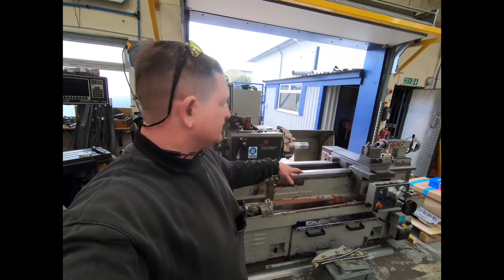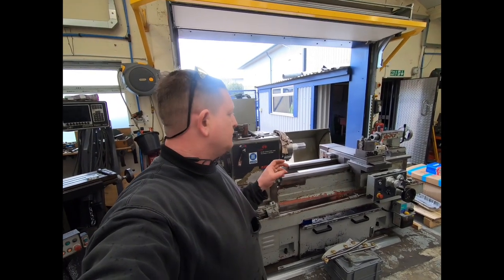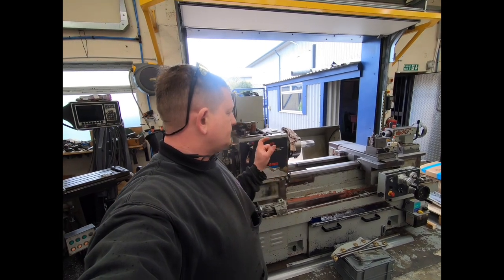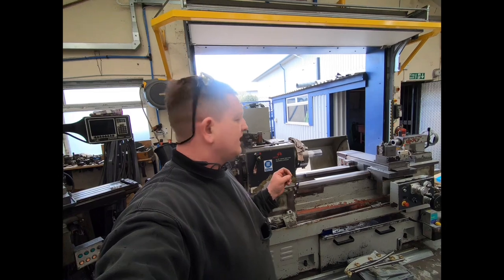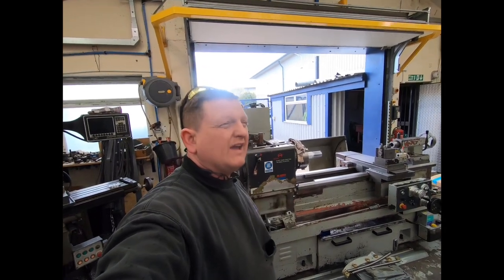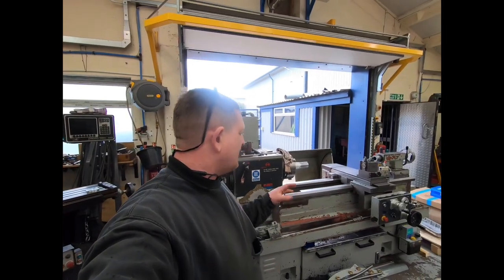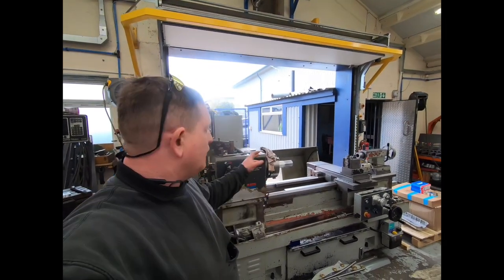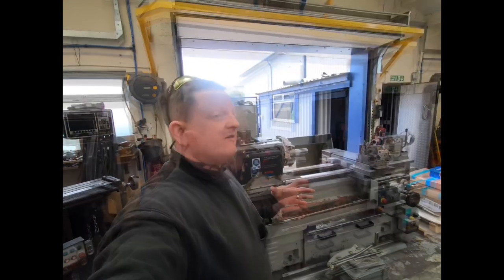The X I tested before I took this apart — the X is very good, really really good. But I have bought new precision bearings for it just to tighten it up, and a support bearing. On the Z, the ball screw has a bit of slop in it. The bearing was quite bad on the Z so I bought new bearings.